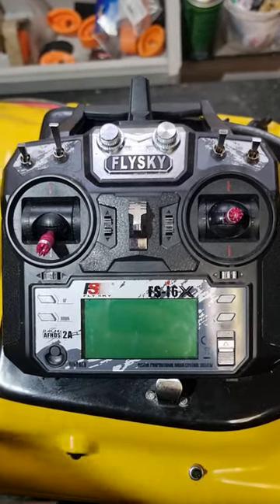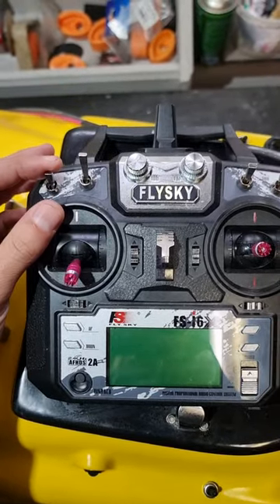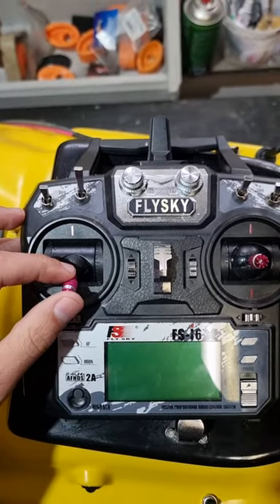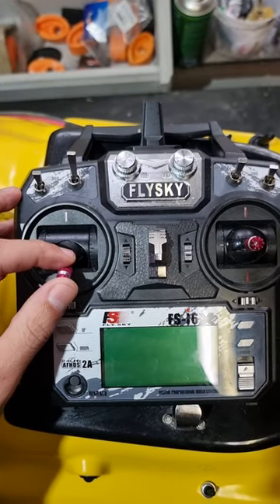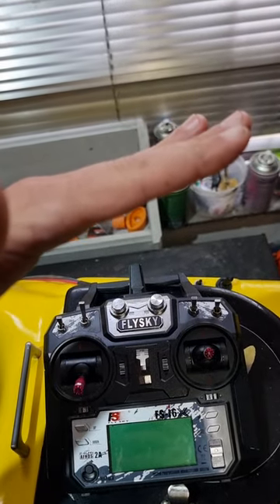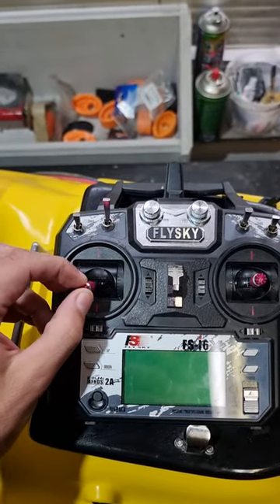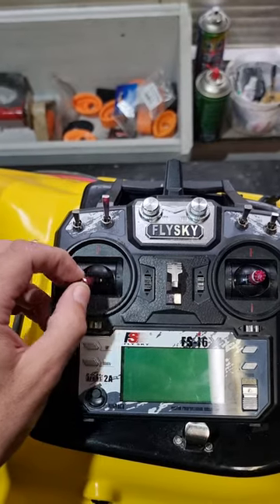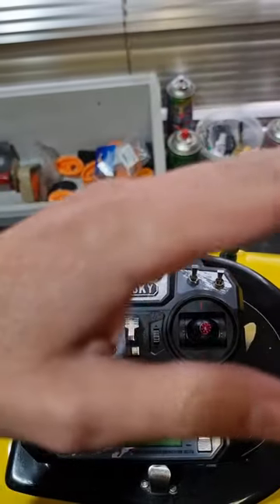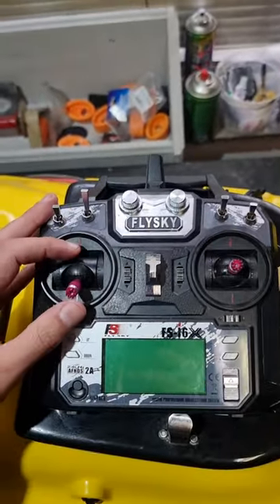The way we set up the camos with fish finders, or for any boat really, is to use the throttle hold option for the fish finder. With a faster boat or slower boats it's fine — you're not going to pick up a deviance — but for the camo, it sits low in the water. If you're using the throttle and steering and trying to find structure with your fish finder, you can't keep a constant throttle. The boat's plane won't be consistent; it would be hopping around.